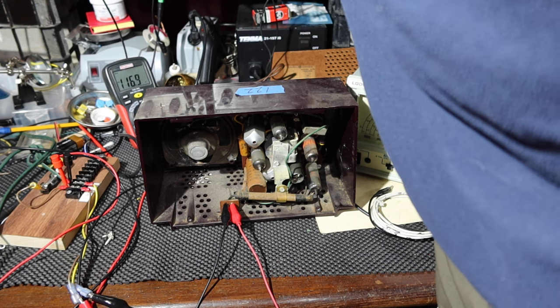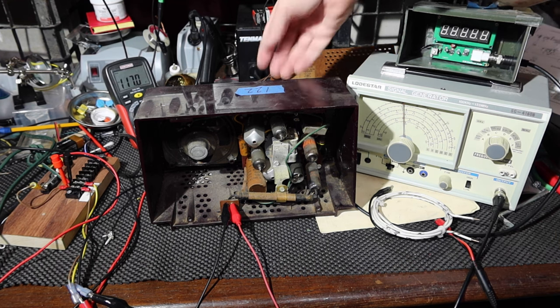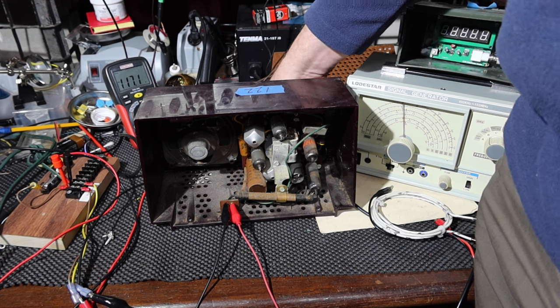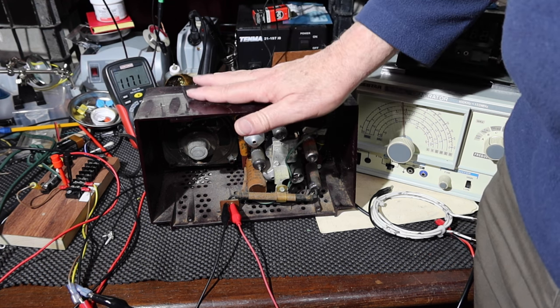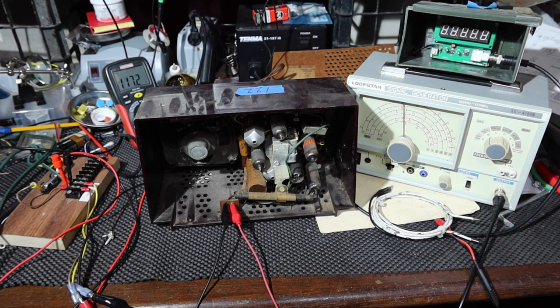Okay, and by the way, on the dim bulb you don't see anything glowing. We're going about 19, call it 20 watts. Alright, so getting a lot of, certainly a noisy potentiometer on the volume. We'll clean that up. I've got it turned on all the way, but the radio's on, okay? So if the oscillator is running, it should be running now, all right?